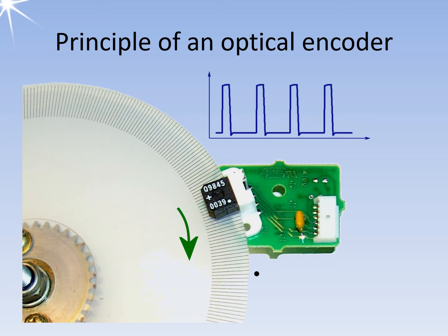An encoder is an electromechanical device used to generate a sequence of pulses depending on bearing angle and revolution speed — the so-called azimuth change pulses, abbreviated to ACP. These pulse sequences are used in a radar set to transmit the bearing angle information from the antenna turntable to the computer or the display units.